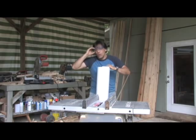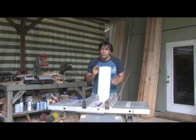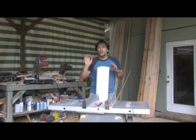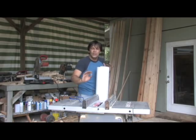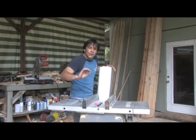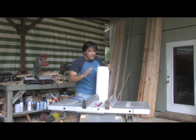Okay, so we have our cut. One thing to emphasize: as you start to cut this it's going to start to pinch on the blade, so when you push it in and get about halfway it's going to start kicking a little bit. Be on the far side and grab it very tight — never put your hands near the blade because it'll jerk your hands right into it. Keep your hands far back and as you get towards the end of the cut, pull it through rapidly.